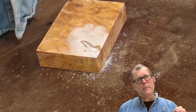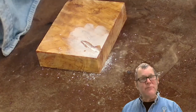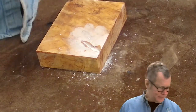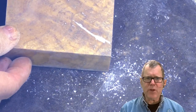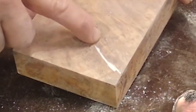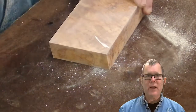I'm going to go ahead and sand this and let's take a look if it's flush or not. Sometimes after you sand it, you still might have a little pit or pinhole. You can just go ahead and apply another layer of the mother of pearl. So there you go — as you can see, it's nice and flush, a little blown out from the camera. I want you to notice that there were some little pit holes in the wood, so any fine pinhole will get filled with your inlay. If you don't want them, you'll want to make sure you pre-fill them with some clear CA.